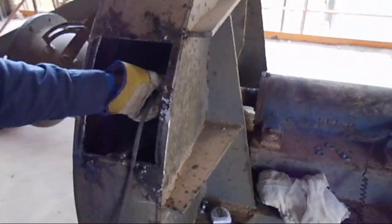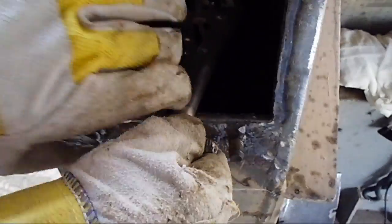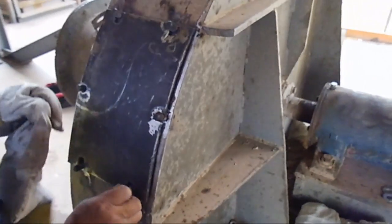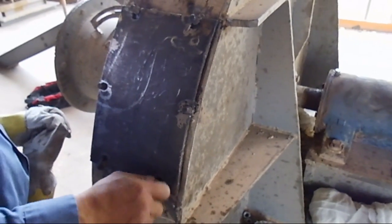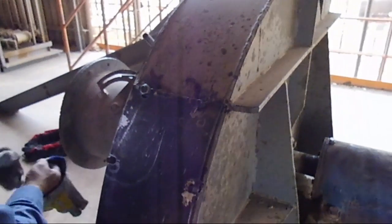The weight is welded on the marked degrees, in the direction opposite to rotation. The welder removes his grip pliers used for holding the weight in place. We fix the door back — the door has been secured. This time the technician puts on just two nuts, which is okay to proceed.